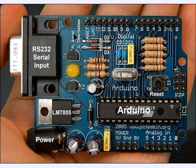Notice along the outside edges up here and down here, here's your digital pins 0 through 13. Down here is your analog pins 0 through 5. They brought them out to a connector so that you can easily connect cables, plug-ins, or whatever to connect up a prototyping board. It also brought out the 9 volts. Here's your ground, and there's the 5 volts from the regulator if you need it. This board, of course, as you see here, is circa 2005.